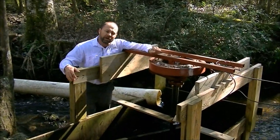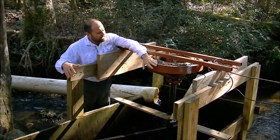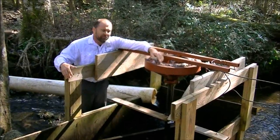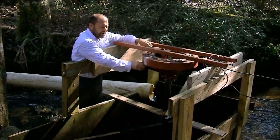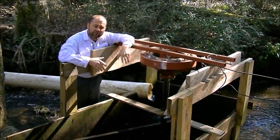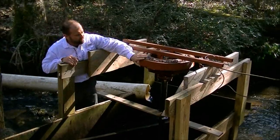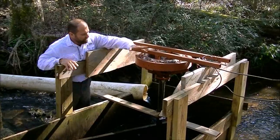Hey, I'm Mark, and today I'm going to show you my hydro generator. It's a homemade one I made. It's 22 inches in diameter, with 28 magnets spinning around 28 coils of number 15 wire. I built it large so that it spins slow — I wanted a direct drive system and not have to have pulleys and transmissions to gear it up. You can use the same generator on a windmill and other applications as well. I've sold quite a few of these to people who've used them in all different ways.